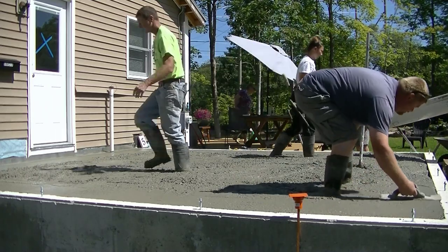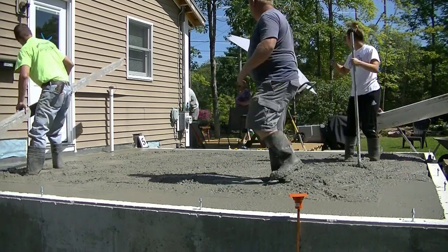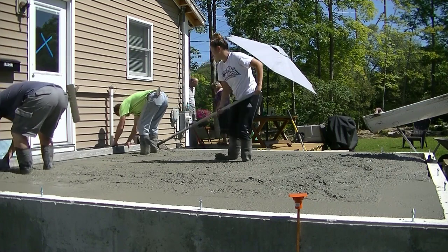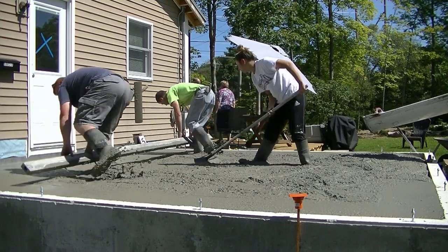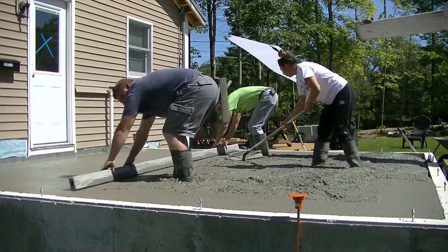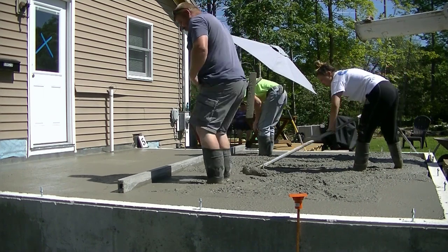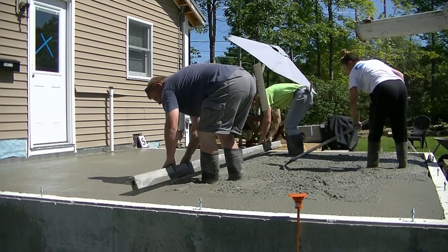We have a 14-foot magnesium screed. I don't have a 16-footer, so we're going to run the edge of the screed board off the section that we mag floated. We're kick screeding here — as we screed backwards we're kicking in the concrete where we move our foot, which allows us to keep going without having to stop too much. If we get low like right here, we've got to stop and push some up and then continue screeding.